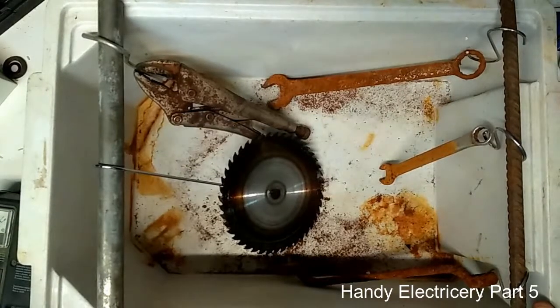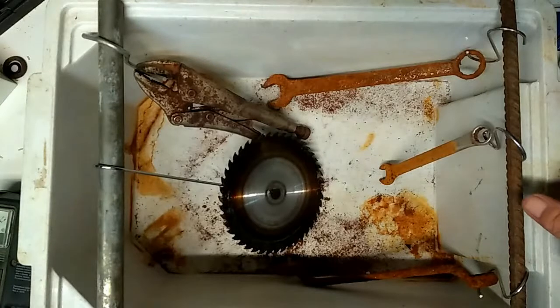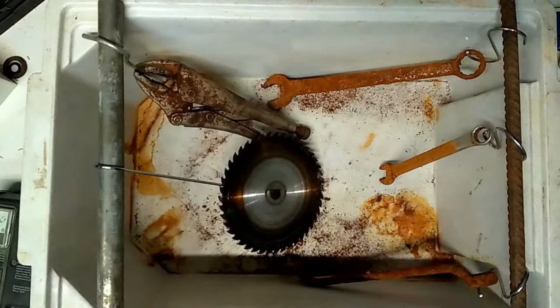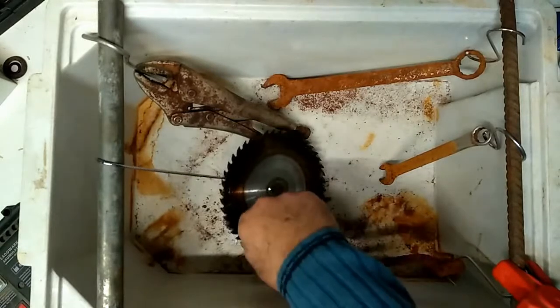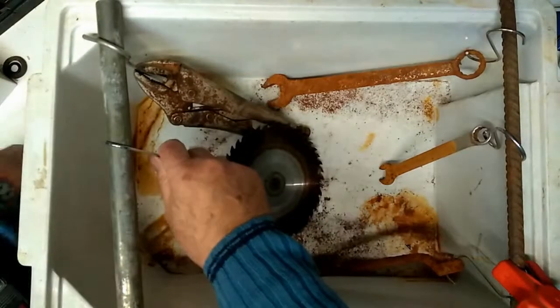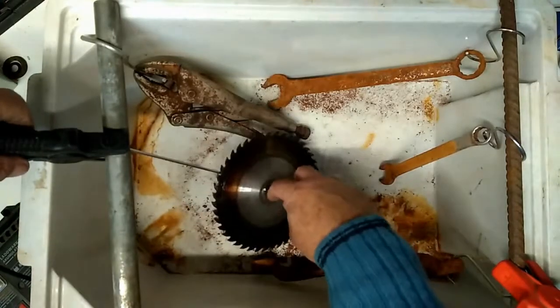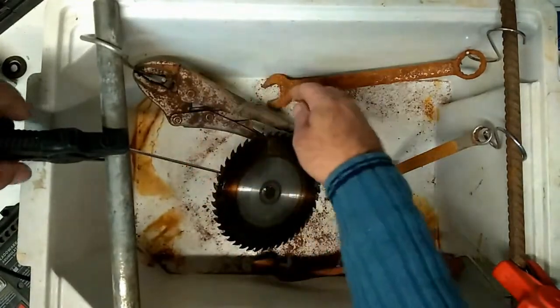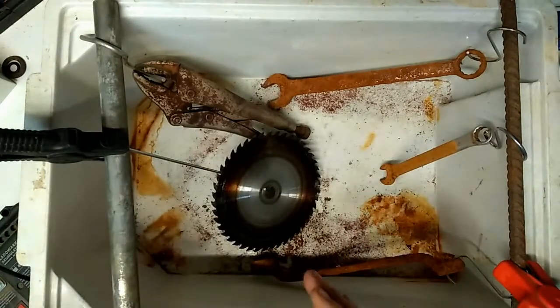This is another wet cleaner - it's an electrolysis de-ruster. This works by having a sacrificial anode, which is this connection here, put on red positive anode. You don't want these touching. And then this is the cathode, which is your parts that you want to de-rust, the metal hooks making contact. I'm not going to be using it, I'm just showing how it would be used.